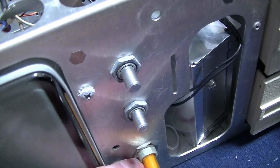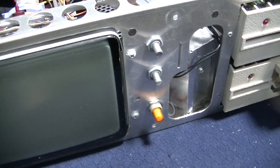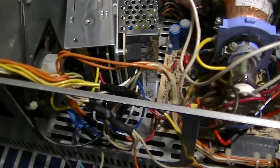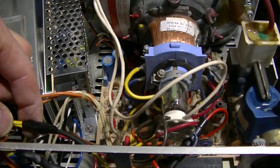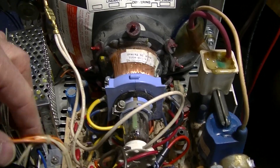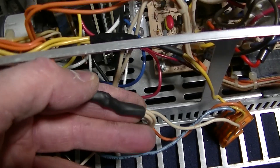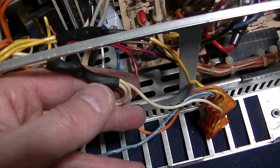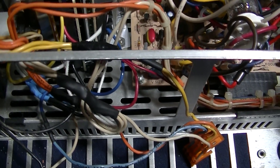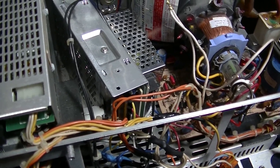It's been a long day. I've got the switch installed with a pilot lamp — it's got a dropping resistor, 1200 ohms because it's on the 12 volt supply, so it will draw 10 milliamps. I've got the two power supplies wired in: plus 5 on the yellow, plus 12 on orange, minus 12 on blue, and ground on the beige or white. The next stage will be to reconnect the printed circuit boards and see what happens. Hopefully I get a beep and some display on the CRT, and I expect the disk drive to start spinning, waiting for a disk.